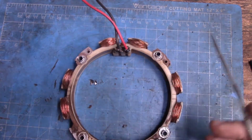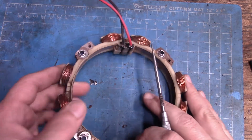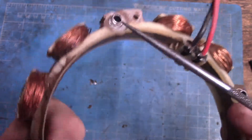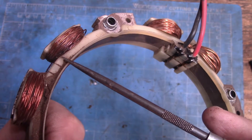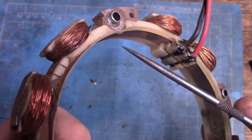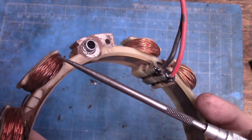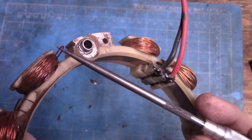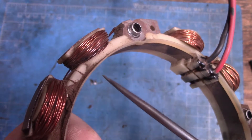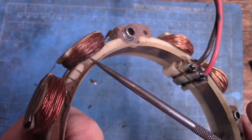I'm going over it and doing some electrical measurements on it, and I just happened to catch something out of the corner of my eye. I started peeling it back and if you look right there, you can see there's a little bit of burn. I stuck my pick in there and that wire is severed — I also found this wire is severed as well. You can kind of see the burn right in there, so that's our fault.